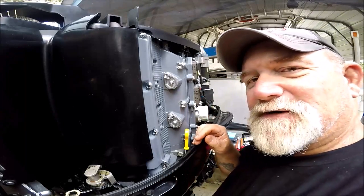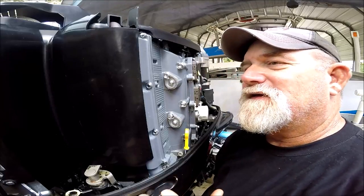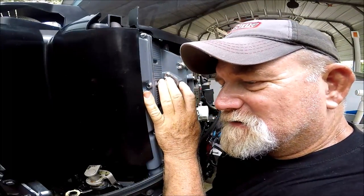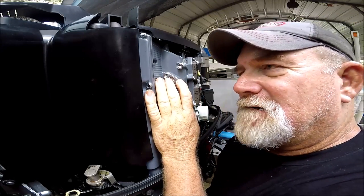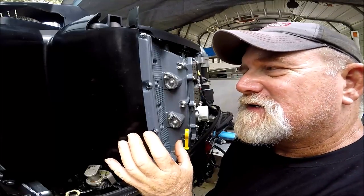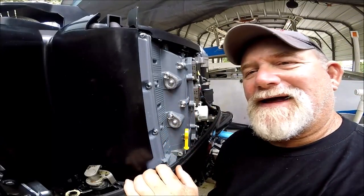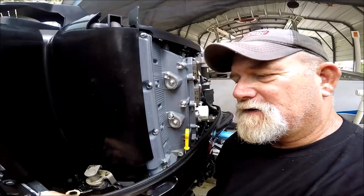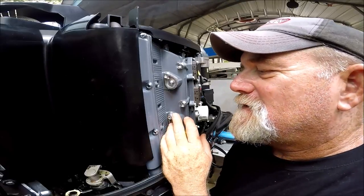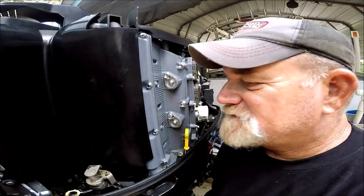It's a piece of cake to do your internal anodes on a Suzuki. I don't know about other engines — only thing I do know is on a Honda. When I had Hondas, they were also inside the water jacket part of the engine, and you had to take all that off. It was a real chore — I think I might have done it once. This Suzuki couldn't be looking out for you in any better way, in my opinion, and I'm not trying to be a fanboy. When I found out these were here and I could easily change them in my leisure, save lots of money, just buy the parts and do it myself, I was all in.